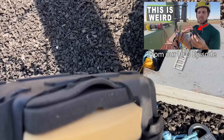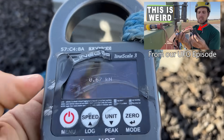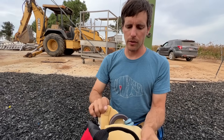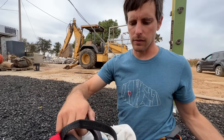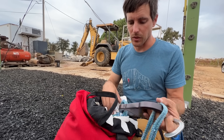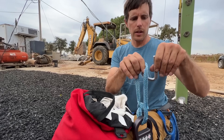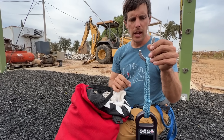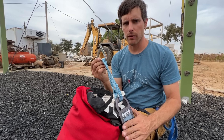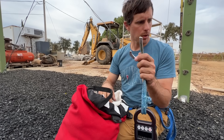What's in the red bag, you ask? I'm so tired of having my line scale threes busted during these tests, so I wanted to super-pad it. This hard foam section did its job - we sandwich it around the thing before closing it. Line scale is fine. Got 9.9 kilonewtons on this thing, but it's not attached to anything because the sling that used to be on there broke. I want this to break before the line scale gets above 30 - I never want to go above 30. But if it got cross-loaded, it probably broke at 10 kilonewtons.